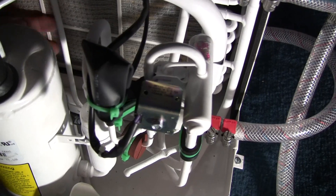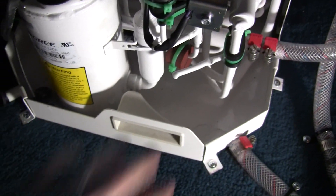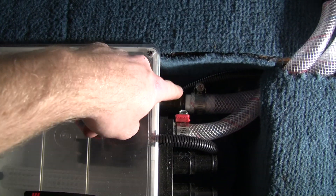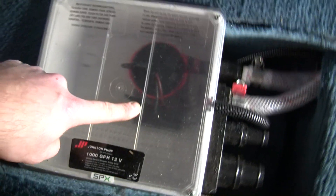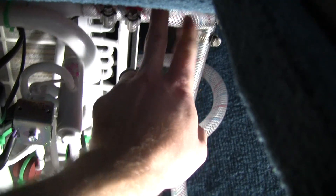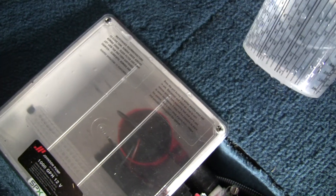This is a removable element — you're really never going to have to clean it, unless you've got a really dusty boat. This condensation tray runs through this line right here, which dumps into this condensation pump. This condensation pump has a check valve right here in line, so any pressure being created from this hose coming back through is going to be stopped. And there's an auto float switch in here too. The unit's running in cooling mode right now, so water's already flowing through this hose and going out of this hose up here. This pump is going to fill up and we should see it kick on automatically.